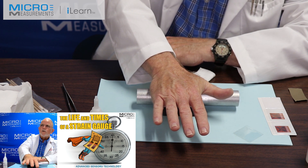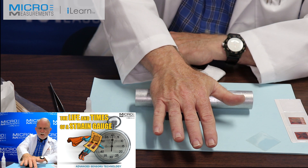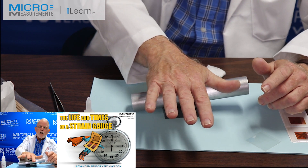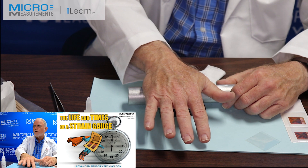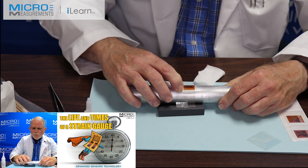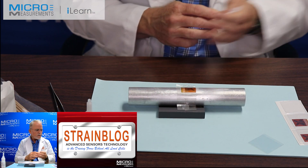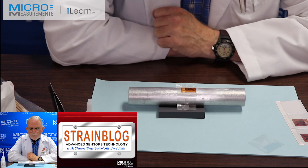This 60 seconds can be the longest 60 seconds of your life depending on your circumstances. I've now reached my 60 seconds. There's the potential because of the large nature of this gauge and the amount of adhesive that I'm stuck. Rather than pull my hand straight up and pull off a chunk of skin, you rotate — that allows the natural oils in your hand to be a release agent. And there we have the bonded strain gauge. Now we wait another two minutes under the tape for the final cure of the adhesive system, and then we can expose the bonded foil gauge.